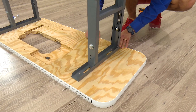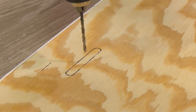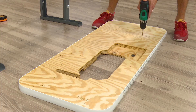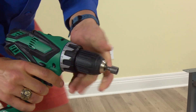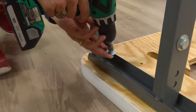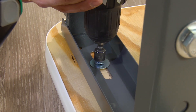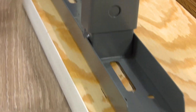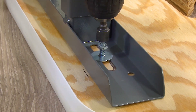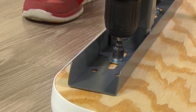Pre-drill the holes with a 5/32-inch drill bit. Do not drill all the way through the table — only drill halfway through; that is very important. Drill in the center of each one of the slotted openings. Using a socket installed on this drill, use the wood screws with lock washer and flat washer and insert them in the holes just made. You could also use a screwdriver or a wrench if you do not have a socket. Do not tighten them down all the way until all four screws are installed, then tighten them down securely.